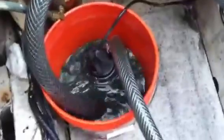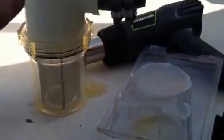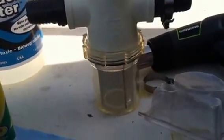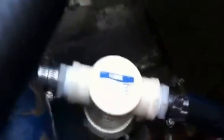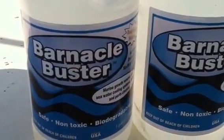When we're done, we're going to flush the system out three or four times with fresh water, put the impeller back in, button everything up, and fire it up. You might also want to consider an inline strainer — this one is a Sure-Flow. You definitely want an inline strainer. I put one on this side and my starboard motor as well. Make sure you use two stainless clamps on all your fittings and offset them — just makes it easier and neater. Pretty simple job. I'll report the results when I get them — Barnacle Buster, this is the fishing vessel Codzilla out.